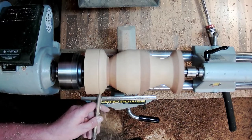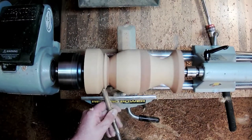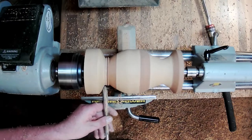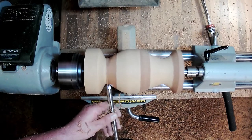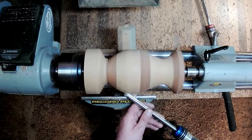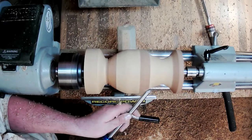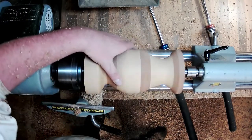Right, Katie's asking, so if and when I get round to making this cake stand, what do you, Wayne, Mark and Steve, recommend it coated with so it's safe for cake? Okay, you've got a couple options here. If you go down the chestnut route, you can get a food safe finish from chestnut products. If you go to Homebase, you can get a butcher block finish, which is food safe and antibacterial. Yep. If you want to go down the wax route, Hampshire Sheen gloss wax is food and toy safe as well. It's what I use for worktops, the chopping board oil.